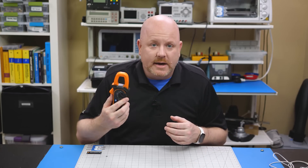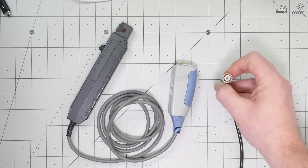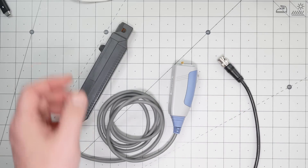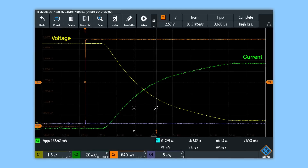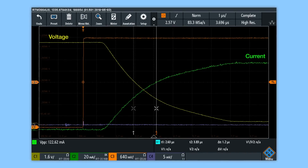In this video I really focused on this clamp meter with the built-in clamp. Before wrapping up, I wanted to mention that you can get both current transformer and Hall Effect sensor types for traditional multimeters or for oscilloscopes — they'll come with banana plugs or BNCs for either. When you use these with an oscilloscope, you get far more resolution and a better look at what the current is doing over time, like in this screenshot where I measured the voltage and current when a MOSFET turned on. But more on that in a future episode.